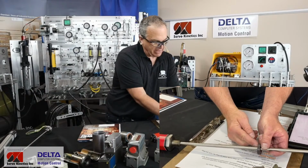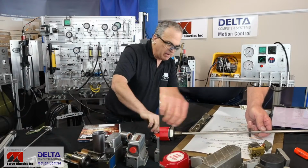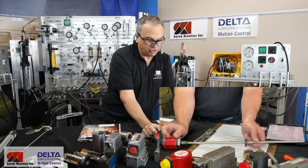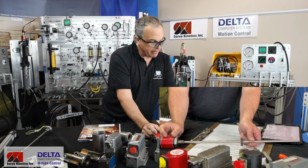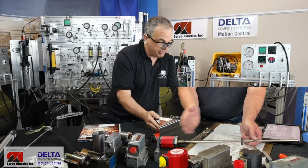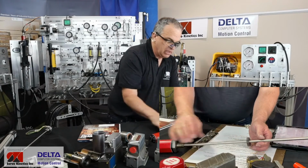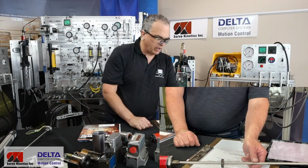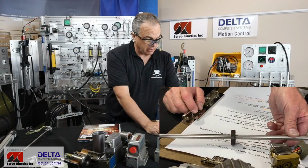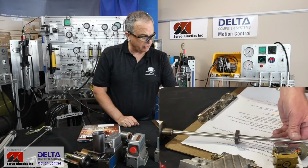It's a constriction of magnetic fields that happen right where that magnet is, and the pulse bounces back to the head, and the amount of time it takes to travel to the magnet and back and be received by a little strain gauge inside, that time is measured, and that measurement is then an interpretation of the physical distance from the sensing head to the magnet, and that can be calibrated and resolved quite easily. You can resolve to 1/1000th of an inch, or even greater detail than that, depending on how long or short the sensor is. It easily resolves to 1,000th of an inch.